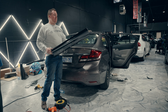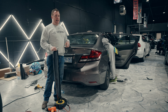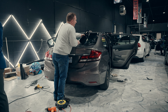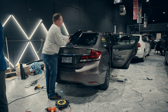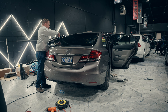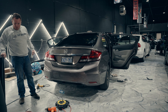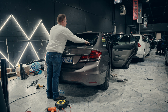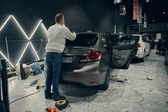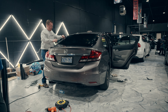We did our outside prep, everything is dry here. If it takes a little bit longer to dry, you can use a heat gun and dry it out. We did our inside prep, now we're going to lay our film. I use a 36-inch roll of film — I want full coverage on the glass. I'm going to roll out the film so we have enough, then do what's called a rough cut. I'm going to line everything up on the glass, do a rough cut with a small anchor in the center, and get rid of anything that's not on the glass.